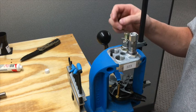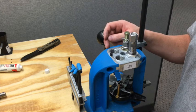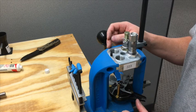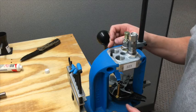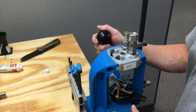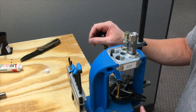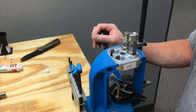The reason I'm doing this is it will allow us to screw the crimp die down until we feel it touch the top of the case, and then give it a little additional turn so that we know it's getting a crimp. That way when we ultimately get to this station, we'll know we're actually putting a crimp, and we can play around with the adjustment. This will save us a lot of time adjusting the die down little by little trying to figure out where the top of the case is.